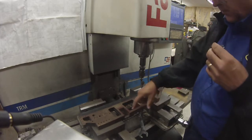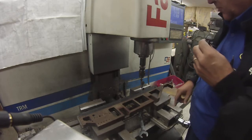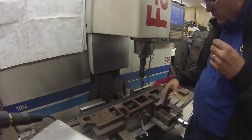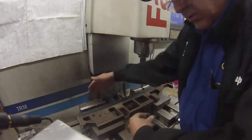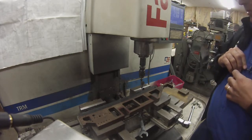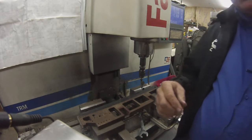If I'd set these a little bit further, I could have done milling here and here and put all the holes in one setup, but no problem at all. Or you can swap your vise jaws, put a jaw here, a jaw here, and you can do pretty good size plate jobs, plate work. You have to skim plates down flat or make some kind of job. And that took about 2 minutes for two vises.